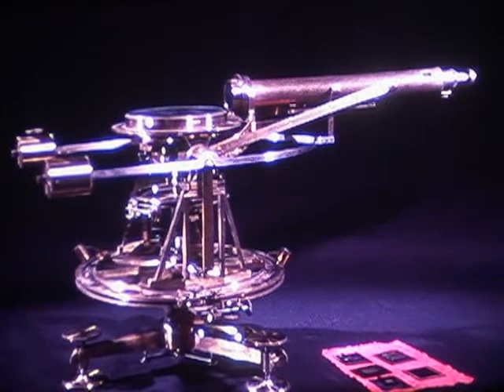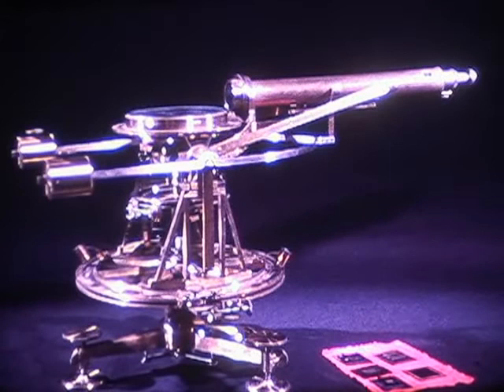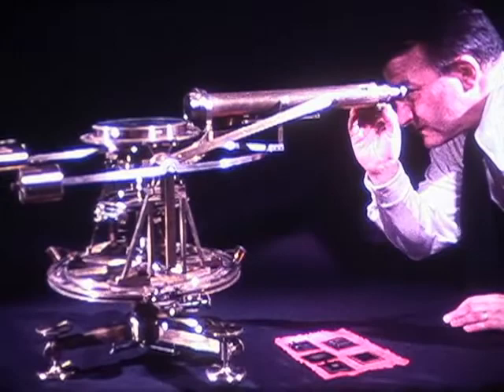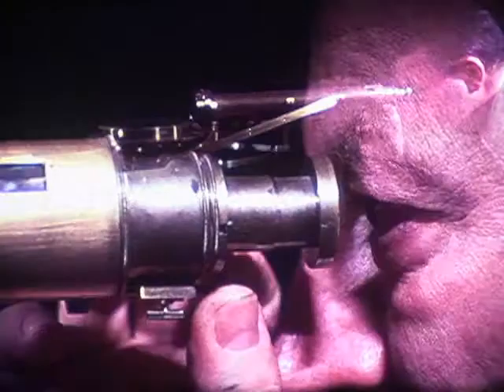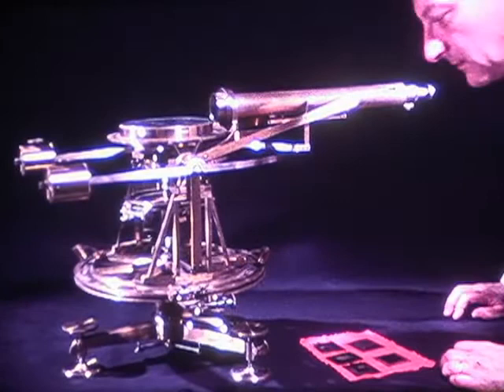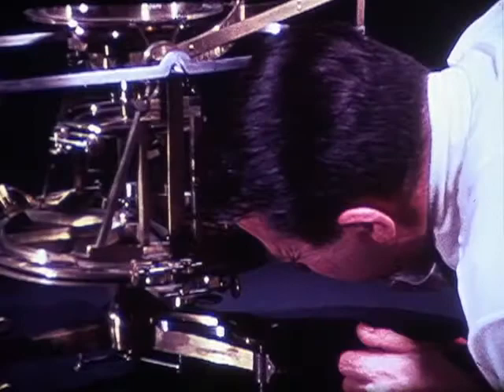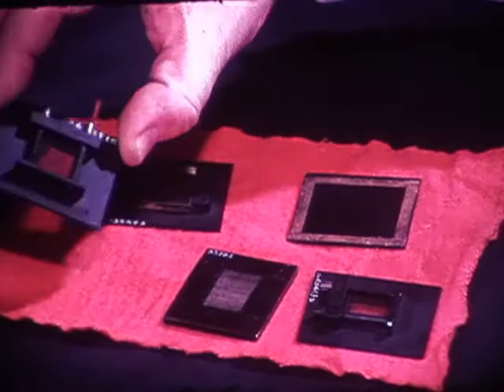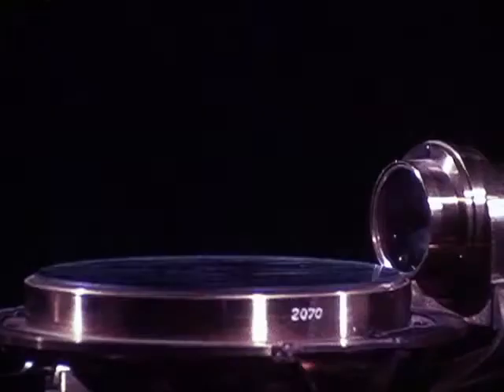This is one of Fraunhofer's own multiple slits. By the way, one calls a system of multiple slits a diffraction grating. He made some of these out of wires laid at precise spacings parallel to each other. He machined finely threaded screws, then cemented wires into each successive thread. His finest wire grating, which has unfortunately been lost, had almost 300 wires laid down at 320 per inch. He built a ruling engine and cut gratings on flat glass and on gold leaf cemented to glass like this one.